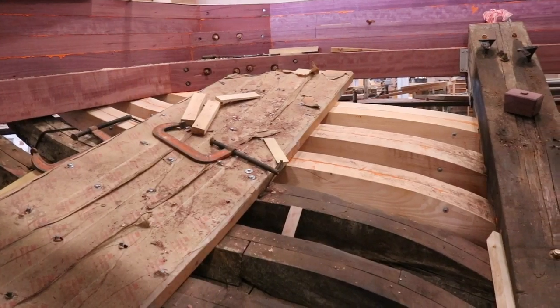And in this video, I just want to dive deeper into the hull framing on the Flyer, or more specifically, that last 16 feet of the boat, where she's built out using 18 pairs of double sawn Douglas fir frames. She was built in 1937 using Douglas fir, and we'll be replacing it with Douglas fir today.